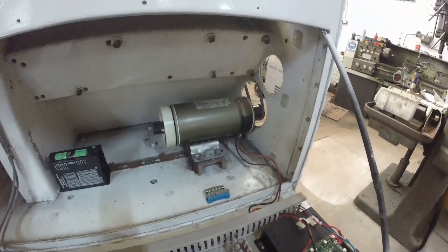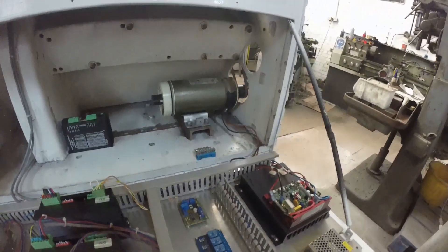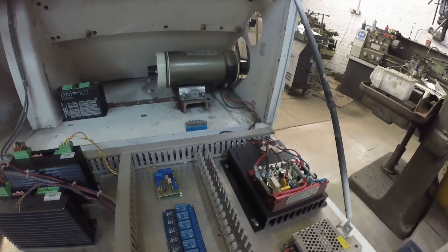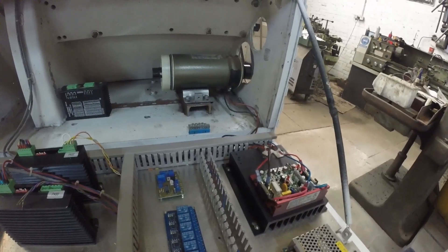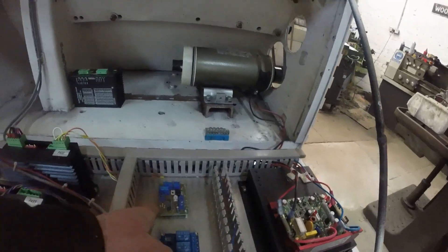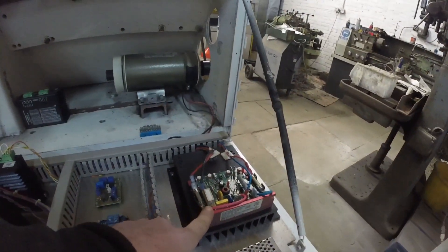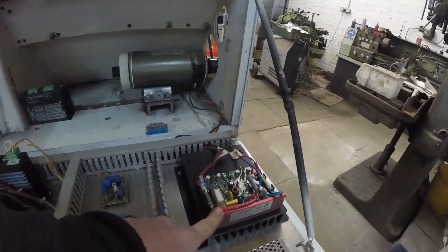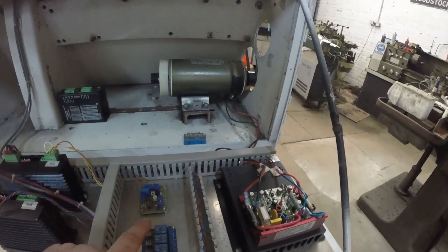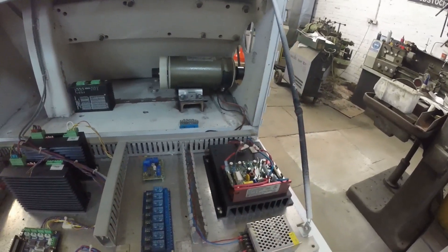For anyone doing their own conversion who has decided to use a treadmill motor and a KBIC control board, just something to note: the industry standard for spindle speed control is usually a 0 to 10 volt DC analog signal, and this is what our CNC for PC board is set up to do. However, looking at the manual for the KBIC board, they use a 0 to 7 volt signal. So what we'll have to do is scale back in our software to allow for that, and I'll show that when I do the video on the software side.